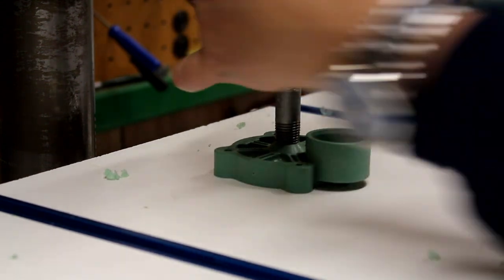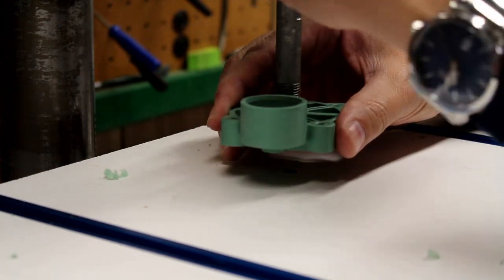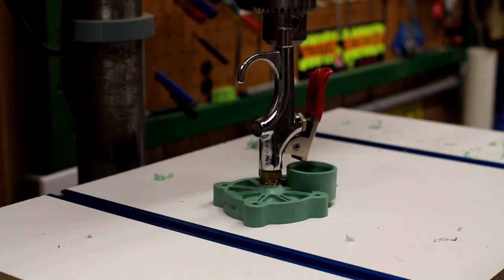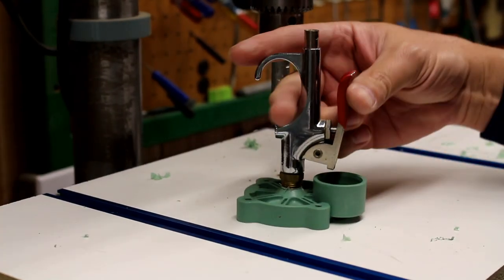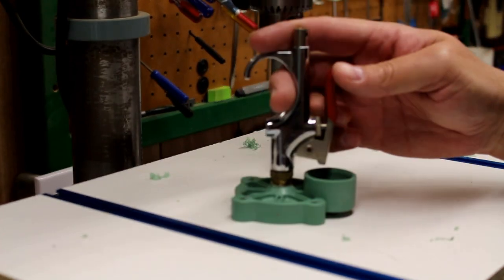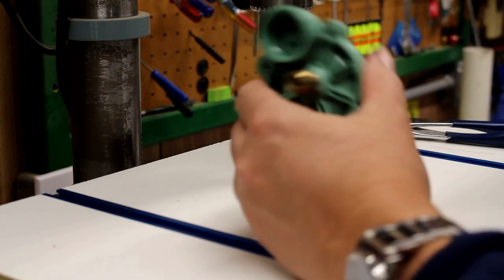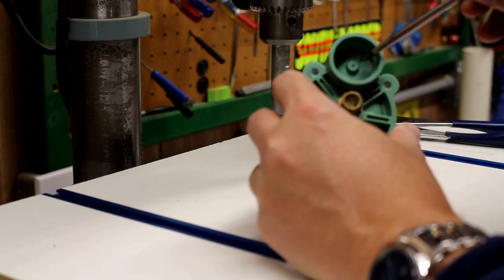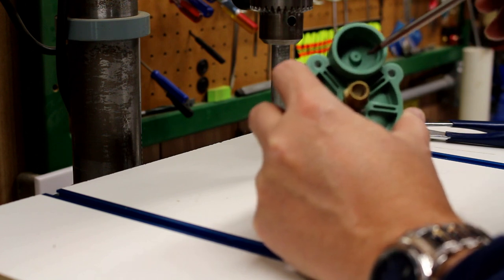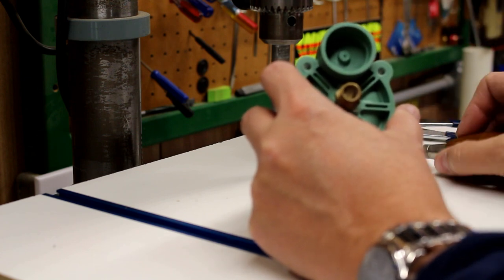In order to thread this I took a piece of pipe and I'm actually using that as a tap to make the threads, which works out really well. I've screwed it in and now I have the trigger mechanism. See how it's gone in there - this is the switching mechanism that allows it to dump the pressure from underneath through that hole and out that little hole. Since I'm going to be dumping out here I don't need either of those, so this whole thing needs to be filled up. The easiest way to do that is to put some material in it and then fill it up with epoxy.